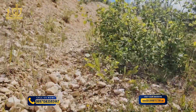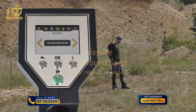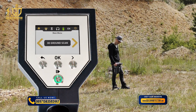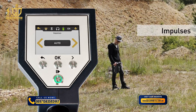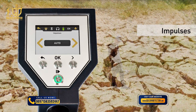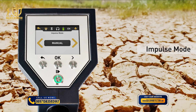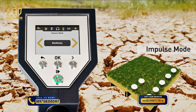In rough terrain, it may be useful to choose the impulse mode manual. Select 3D ground scan and adjust the parameters: impulses, impulse mode, scan mode and transfer mode. Set the number of impulses — we recommend auto. In manual mode, each measure value will be recorded manually by pressing the Start/Stop button.